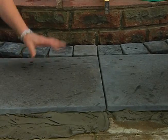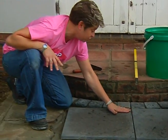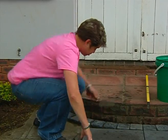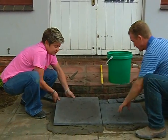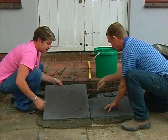As you're going along with your smart tiles, you're going to find some imperfections where it's not really all that level, just like this here. Here's a perfect example. But now let's just fix this quickly. Importantly, put a trowel underneath it and lift it up, because it forms a bit of a suction, and put a bit more of the mixture underneath there.